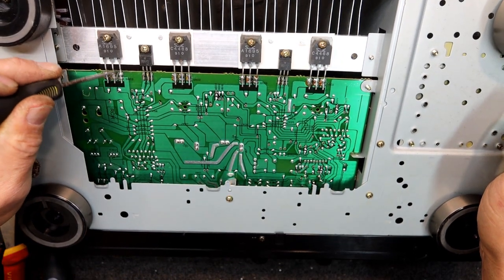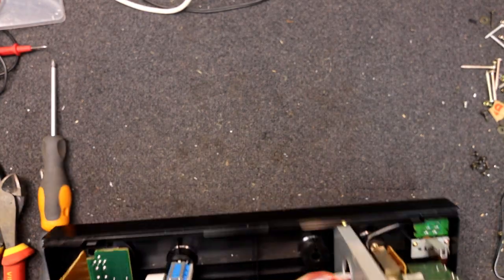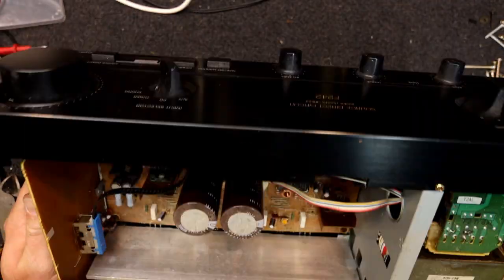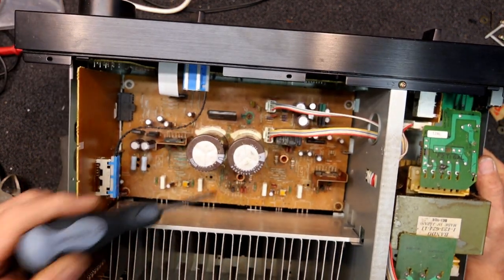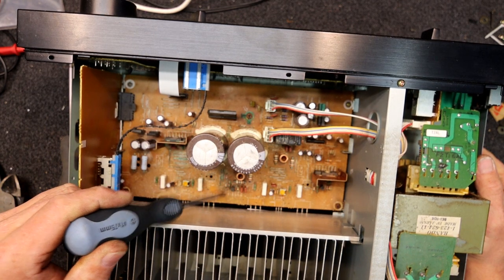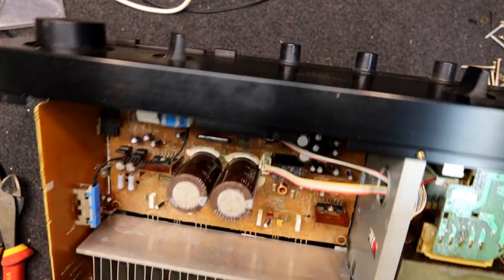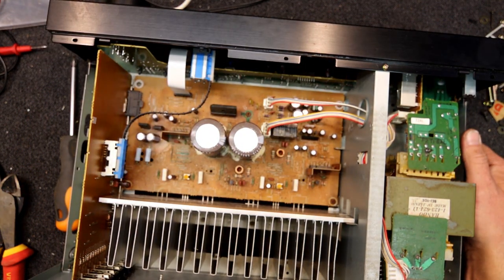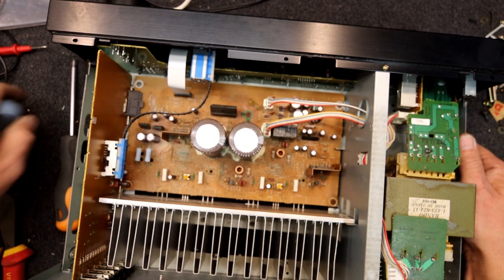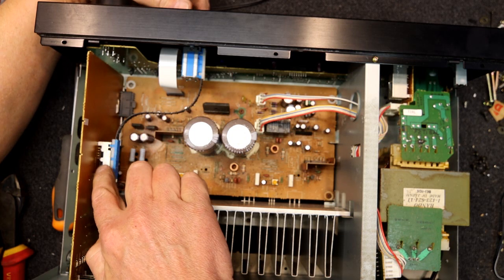It might be up for an hour or two's work to disassemble and clean this at a minimum. This resistor here has got like a growth of rust on it, so that may need replacing. The board on the top side certainly needs cleaning. The upright board looks okay hopefully. The main problem now is getting a replacement for that function switch that goes via a mechanical link to the input select knob.